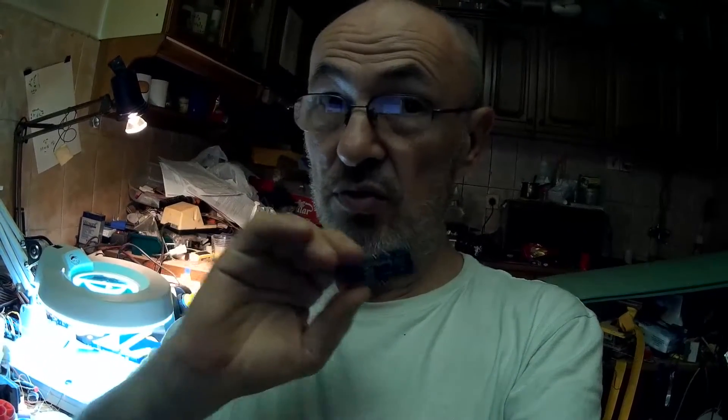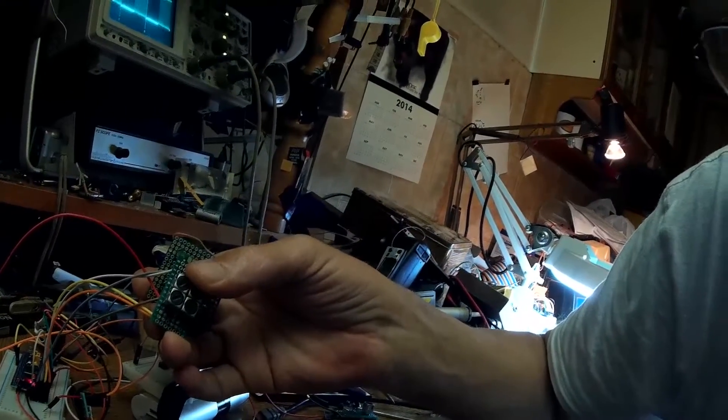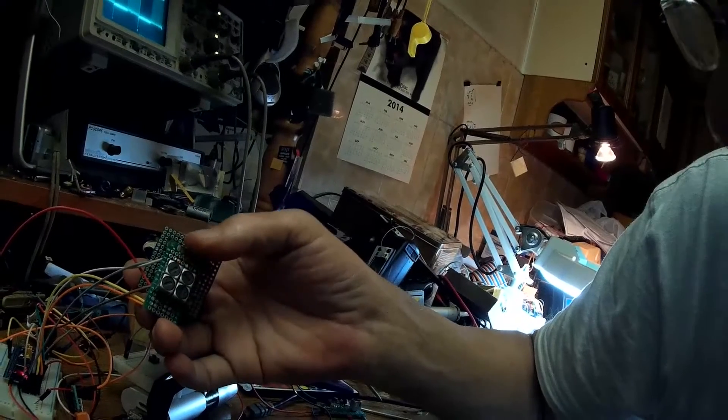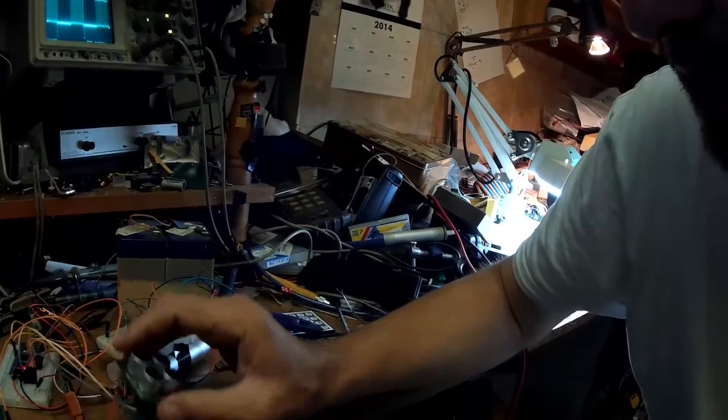What is the problem? This board is powered with 10 volts — actually 20 volts peak to peak, plus/minus 10 volts — with an RS232 chip. I'm driving it with MOSFETs on board and 4 transformers. Each transformer output is about 100 volts, a little bit more at maximum. The voltage for one transducer is 150 volts peak to peak.